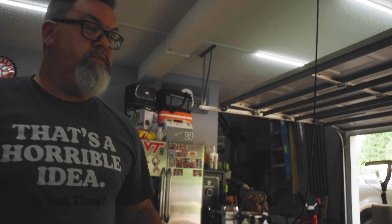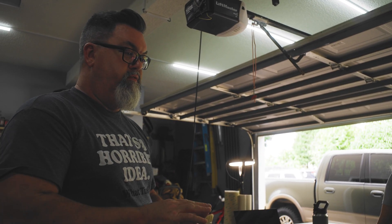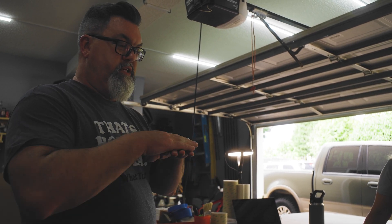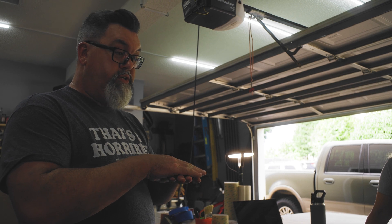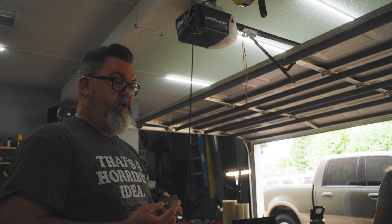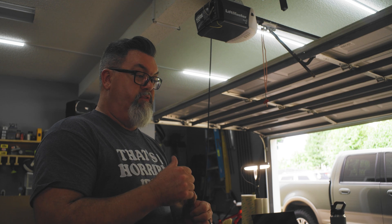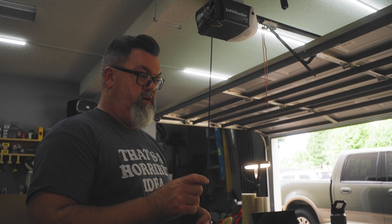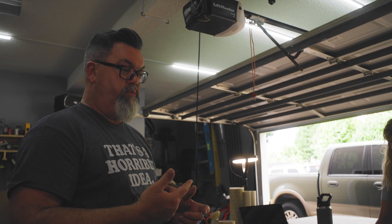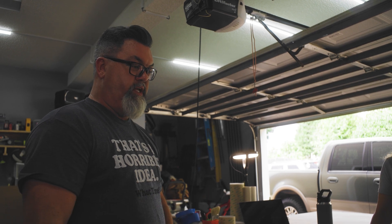This is the third cut of the large logo. We did two already and we're going to make it three-quarters inch thick using one-quarter inch material, so we'll put three layers together and glue them up. The first two layers have pre-drilled holes for where we're going to insert the standoffs for the wall — we're going to use a two-inch standoff. Instead of having to drill later, we just pre-cut those holes and then insert the bolts with some adhesive, which makes it really easy to install.